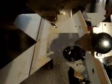Lots of sawdust in the air, which is not good for the lungs or nasal passages. Sawdust is a carcinogen. Also, sawdust drops into the router motor, making motor burnout a real issue. Sawdust flies all over, coating the router table surface, the cabinets, the floor, and virtually everything else in the workshop, making cleanup a long and tedious process.